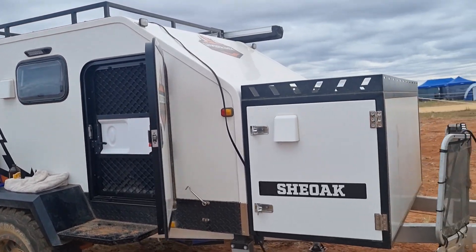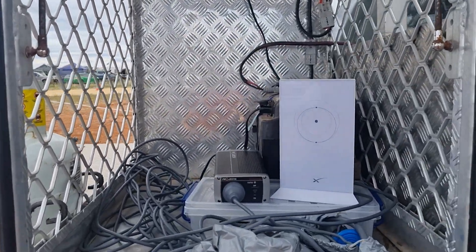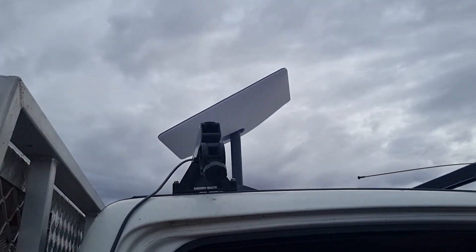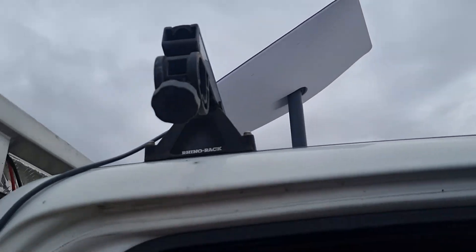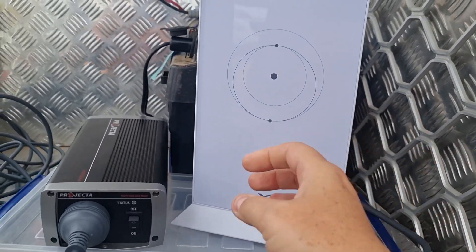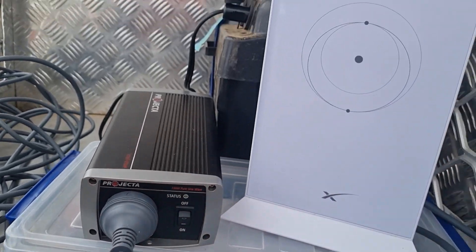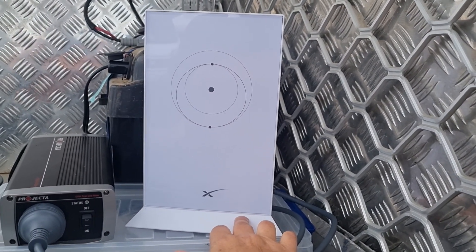This is my camper and I've chosen not to set it up permanently in here because I intend to use Starlink at home as well — it actually works better than my home internet with Telstra. I've mounted my dish on top of the car, and when I say mounted, it's just sitting there. The dish comes with a very long lead that runs all the way down into this box. This box needs to be powered, so I'm running it through an inverter that plugs straight into my battery box. The Starlink dish itself is waterproof but the box is not, so you'll need to put it somewhere safe and dry. That's how easy the Starlink is to set up. You could make it neater by permanently wiring it into your van, but I don't need to do that since I intend to use it at home.